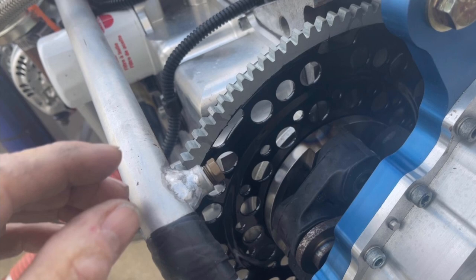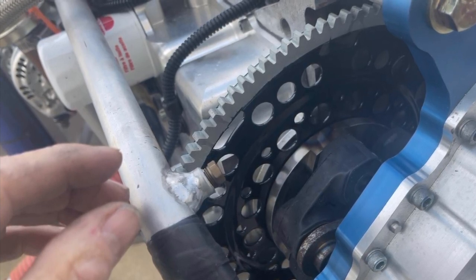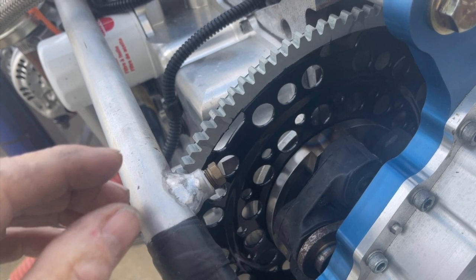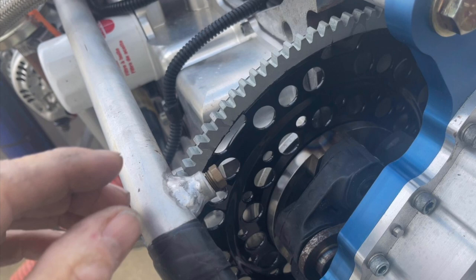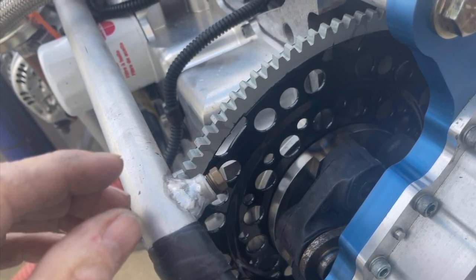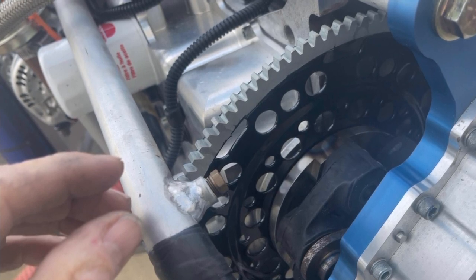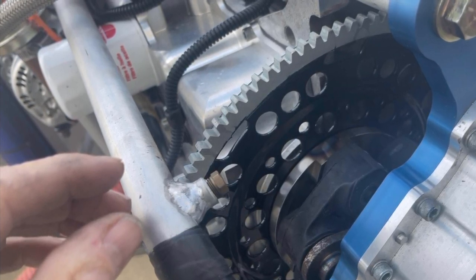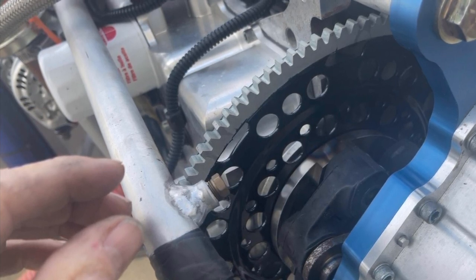Now this procedure is all orderly, but we did just throw this together for a video, and someone, that being me, tossed those rubber dampers on in the wrong direction. So everything you see here is correct procedurally, but the rubber donuts are actually stuck on backwards. They're supposed to be so that the engine pulls the gearbox like we showed before.